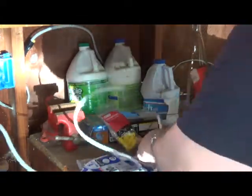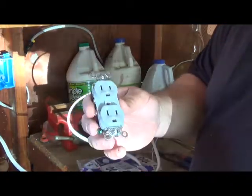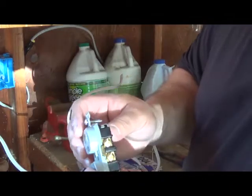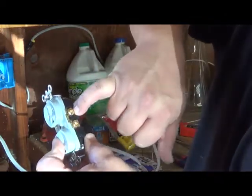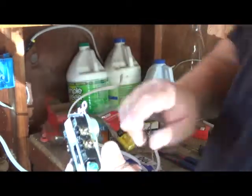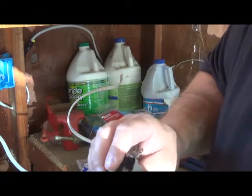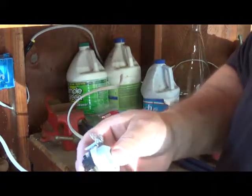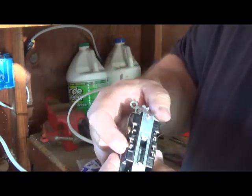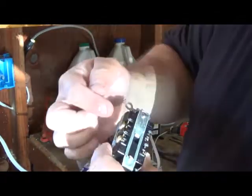On an outlet, all outlets are the same. This is just a standard outlet because it's in the garage. If you were doing this in a bathroom or kitchen, you would need a GFI outlet. The main thing to remember on these outlets is black goes on brass — you're looking at the color of the screw. Black goes on brass, white goes on silver. Then this green one over here is ground — think of green grass on the ground. Hooking this up is pretty simple. You have two screws on each side: one for your power coming in, and one screw for the line going out if you have one. So because this is in a series, we're going to be using both screws.